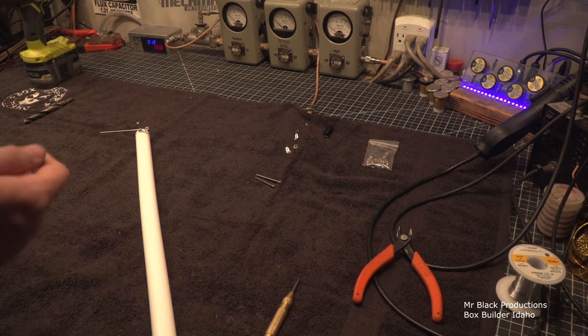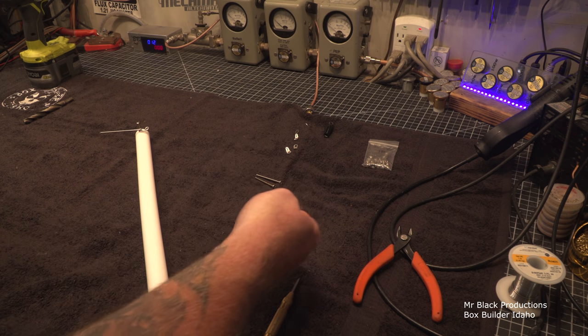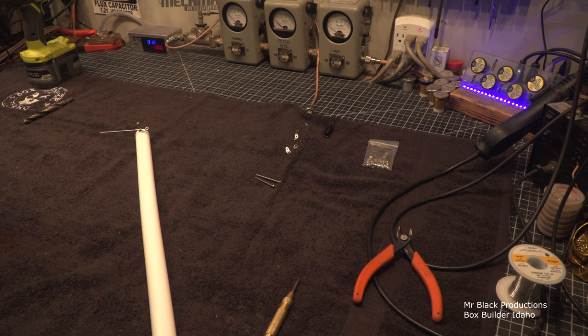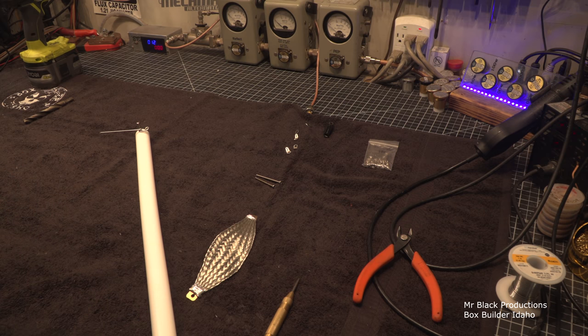And if I wanted to stand there all day and hold it, with my meter I could verify it was grounded, and that meter would act as an additional bleeder circuit, presenting an incredibly high but conductive resistive load, pardon me, to the circuit, and you could bleed the high voltage off that way. I'm building this for the opposite side of that spectrum. I'm assuming the bleeders are already done.